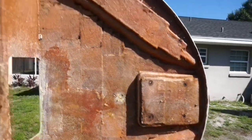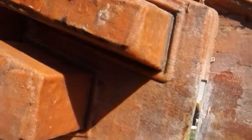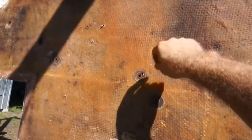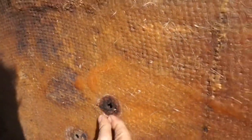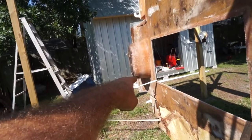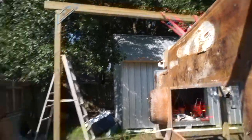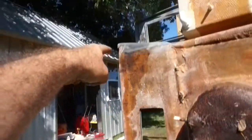All of this looks pretty solid — this was the bow portion, I'll probably leave this alone. This portion right here also looks relatively solid all the way around, so most likely I'll leave that too. I'm just going to focus on this area — it's hollow, you can see there's a lot of deflection on that bolt hole, the wood's rotten. You can see up inside of there it's gone. So I'm going to be removing this area all the way back to the back of the opening where the fuel tank goes, remove all of this and replace it. I'm also definitely going to remove this section right here and replace this as well.